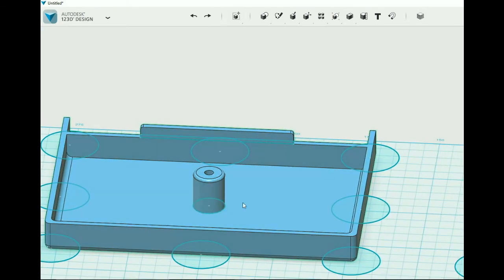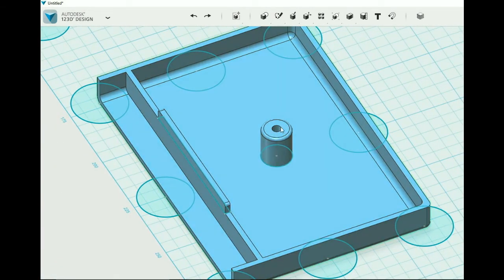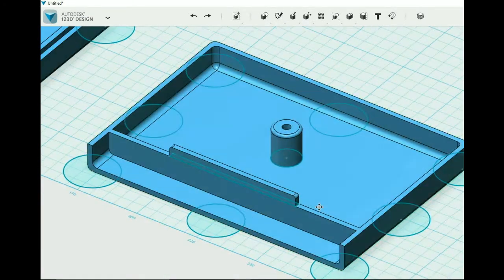But in either case, this right here is just built there for the screw to go into it, actually. And I'm probably going to end up changing this a little bit. I want to actually make this hole just a little bit smaller. And the reason for that being is because whenever I put some screws in the cartridge shell that I showed you earlier, I noticed that it wasn't very tight. Not as tight as I would like, anyhow. So I'm afraid that you may end up having issues with it stripping out and things like that. But we'll see. We'll play with it and see what we can come up with.